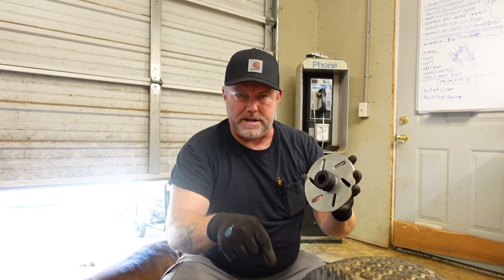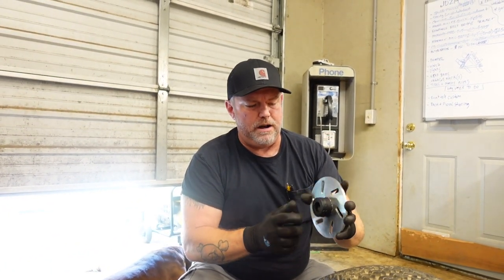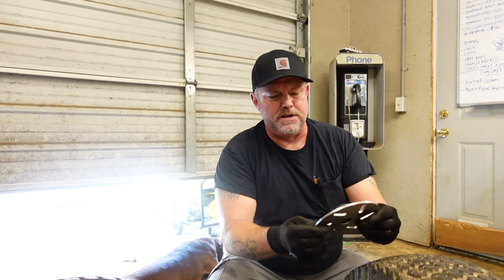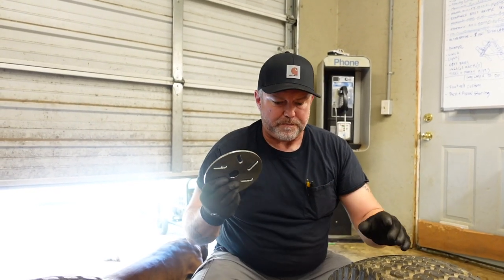So I got another hub for a one-inch keyed shaft from a tractor supply type store. If you saw the shorts we made — I'll put some clips of that — we basically turned my Peerless A20 transmission into an improvised lathe. I took that one-inch keyed hub, cut a piece off it to fill in that extra space on the shaft, cut the center out, added two more set screws, welded it up all the way around. Now I have extra hub thickness, extra keyway engagement, and four set screws total.